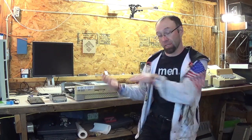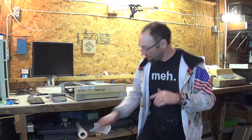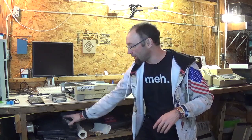Back to the Ultra 5. The next step is to figure out where it's getting stuck. And without video, obviously, our vector into that information is the serial port. I'd done a bit of faffing about, and I think one of my serial cables had gone bad. And at the time, I wasn't sure if maybe the Sun was so badly screwed up that it wasn't putting anything out to serial either. So I found the cable that I ran the 6800 from with the null modem block on it. I know that's a good cable and a good null modem block. We'll hook it up to one of the laptops and bring up Minicom, and we'll see what we can see, and hopefully get a clue as to what might be smoked.